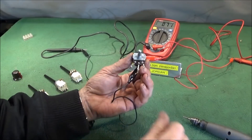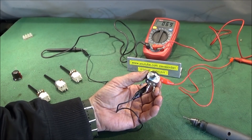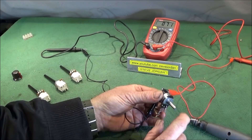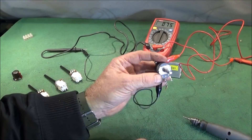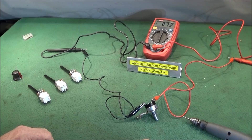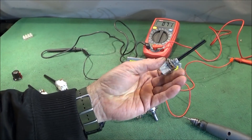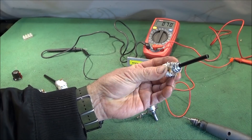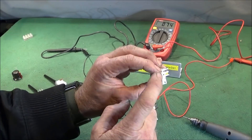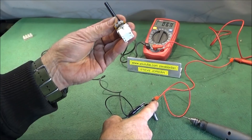When I did that video, someone kindly wrote in the comments section about a much cheaper and much better quality alternative. These ones cost about £10 and you have to get them from the actual lathe supplier, so they're not cheap. But this one here is from Maplins and it only costs £1.50 - it's a much better potentiometer with a really good switch mechanism inside and they last a lot longer.